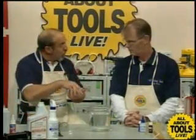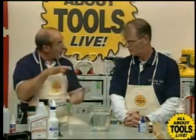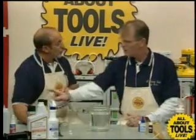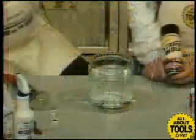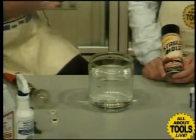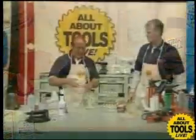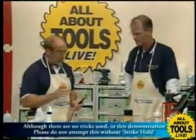Unlike any other product, it actually goes through the water. Other products like PB Blaster, if you pour them in a cup of water, lay on top of the surface and do nothing. If you actually put this in, it goes through the water and will eat a styrofoam cup like that. How long does this last, though? It lasts for 5 months on a non-moving part. So it'll waterproof for 5 months, like an electrical connection. But if it's something that's moving all the time, you want to keep spraying it on a regular basis to keep it protected.